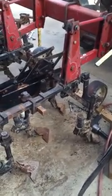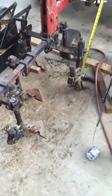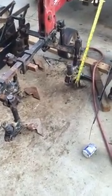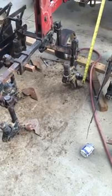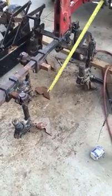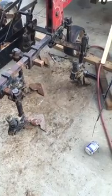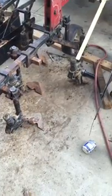And you want full 8s on 1, 2, 3, and 4, or do you want full 10-inch on 3 and 4? On the front sweeps, I'd like to see you start out with full 8s. I think you'll get along better because there'll be more distance from the shank to the fender. You can put the fenders as far out from this as you possibly can. And on the back, full 10s on 3 and 4 is what I've run for years. On 3, 4, and 5, you always set them as flat as you can and still get them in the ground.